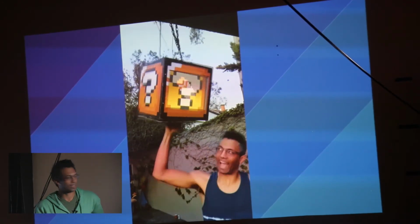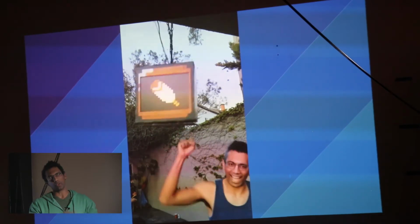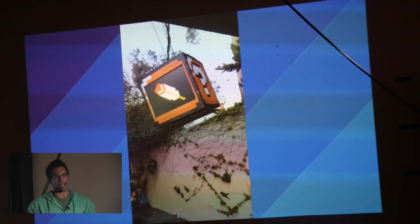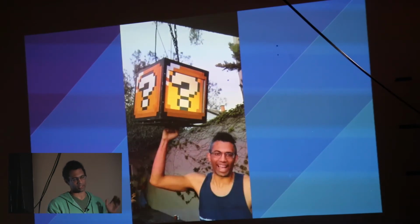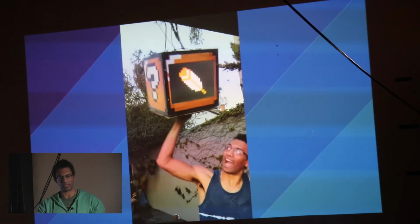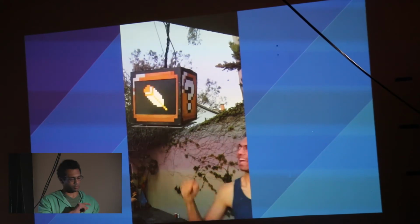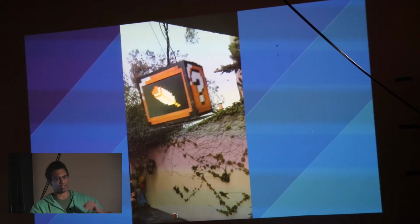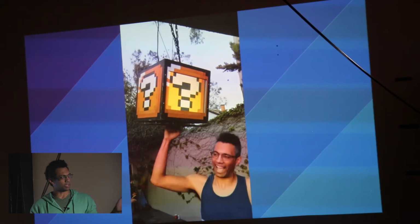Why does it need to stay on for 100 milliseconds? So when I was coding it, I noticed that the Raspberry Pi started to heat up quite a bit, and it started displaying a thermal warning on the screen. I had a while loop in Pygame, and it basically was maxing out the processor. And so I put a sleep in for 100 milliseconds, because that seems like it'll just fix the overheating issue, and it did. But it meant that it was only picking up inputs from the pin every 100 milliseconds. And so if it wasn't on right as it was trying to sense, because I made a mistake while coding, it wouldn't pick it up at all.